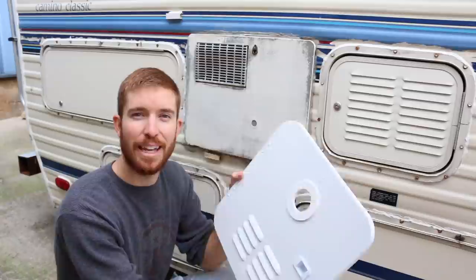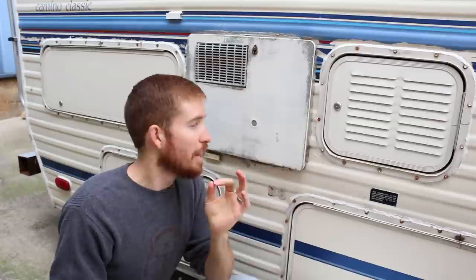I also checked and looked at the door that covers the hot water heater. The hot water heater itself is the correct unit, but I need a specific door to fit my specific RV so it can retrofit. This door is meant for a Suburban hot water heater, and they have multiple different doors with very confusing drawings and no dimensions for vent placement — only overall dimensions. So I measured what I need, found one that will work, but I need to order it before I can actually install the unit and ensure it's waterproof. We'll continue this on another day.